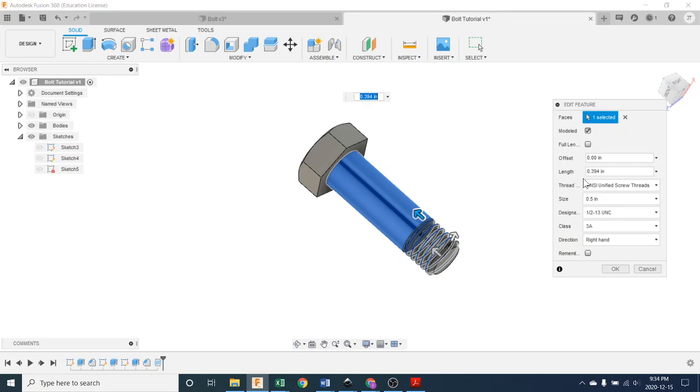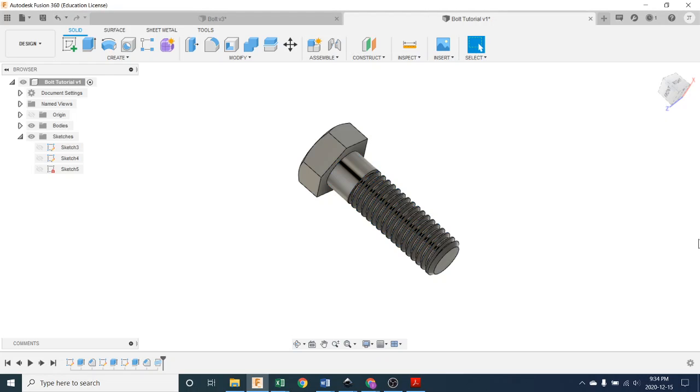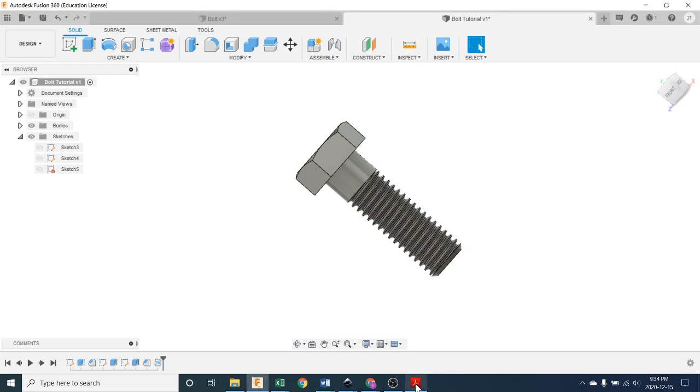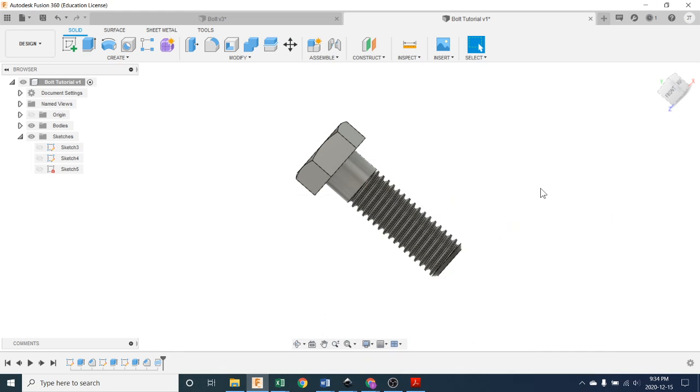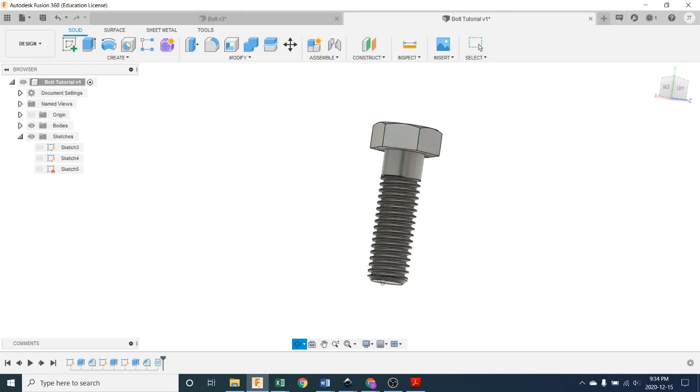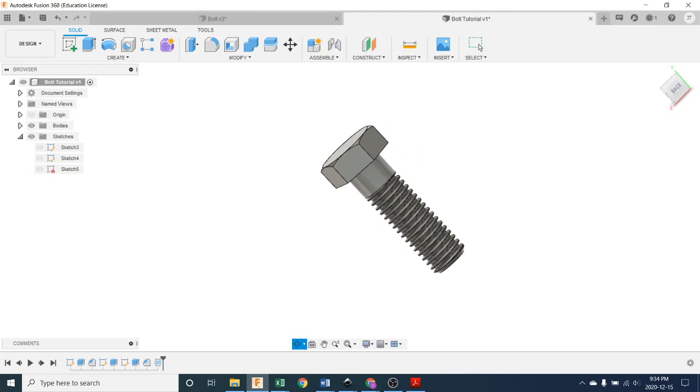So then it's saying how far? Well, the distance that a partially threaded half-inch Unified National Coarse cap screw is 1 1/4. There. Now we've got them the right distance. So if I go back to this, you'll see this goes up that far, 1 1/4 inches, and so does mine. Okay, so the cap screw has been modeled. The next video we are going to model the nut.